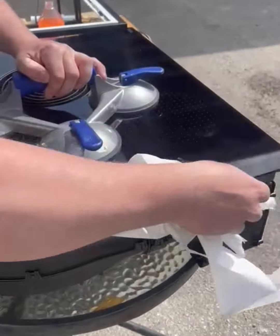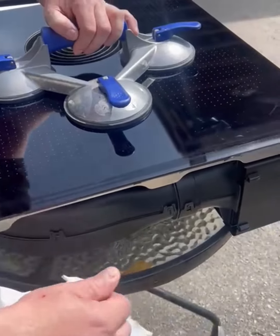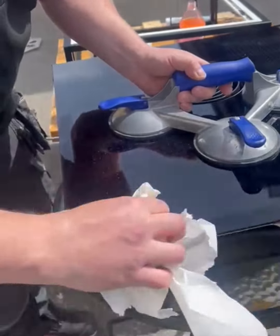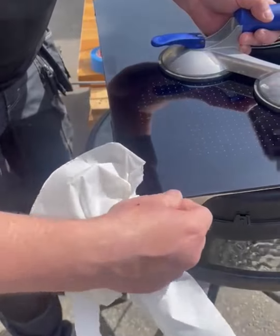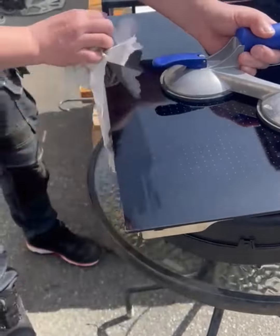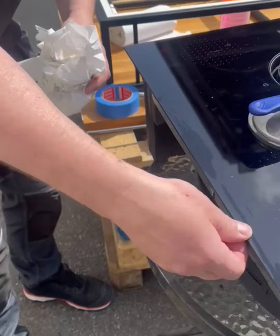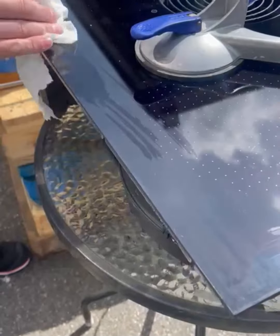But I see you have some rest of the silicone. Yes, that we get rid of, as I said, so we don't need to be that gentle. Okay. But of course we remove that one. All those hanging pieces, there cannot be anything loose. Otherwise, when you put the fresh silicone, it might stay out like that. And of course, the result is messed up.